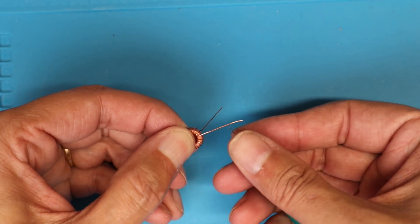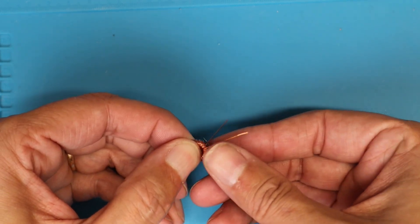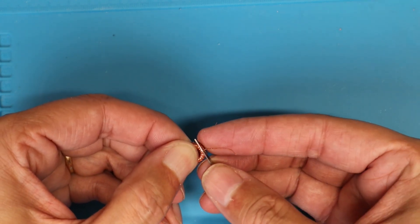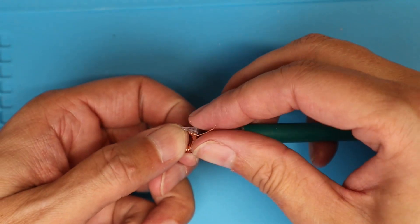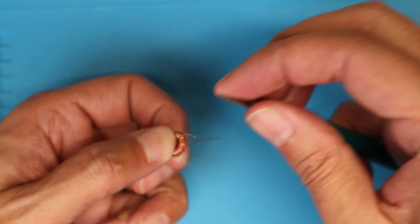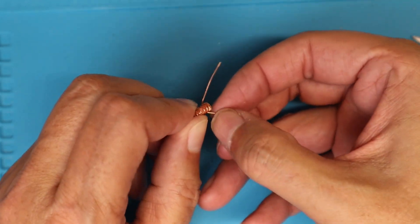Once you have your toroid wound, you have to be able to solder it in place, and this is the next little gotcha — getting the enamel off the wire so you can get a good solder joint. There are a lot of methods for removing the enamel, but I'm going to show you my favorite, which is almost 100% guaranteed to get a good solder connection. I scrape off the enamel of each lead with an X-Acto knife. Be careful not to nick the wire and break it — a light pressure is all that is needed. Better to go over it a couple of times lightly than to reef on it and break the wire. I go over each wire in four directions to get as much enamel off as possible, then rub off any remaining enamel with my fingers.